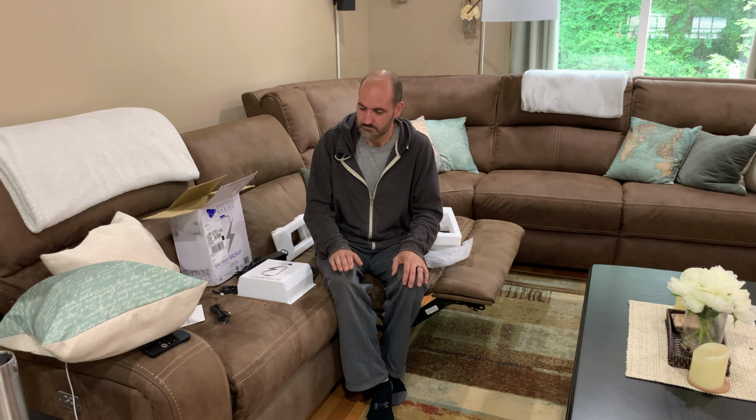People don't know that most big generators that you buy at Walmart or whatever, the Champion brand or most brands, if it doesn't say inverter generator, it's most likely a modified sine wave, which is not the same as your AC outlet. Now you can power certain things with that, but you shouldn't be powering anything that has a computer in it. Okay, it will damage it, and if it doesn't, you'll be lucky.